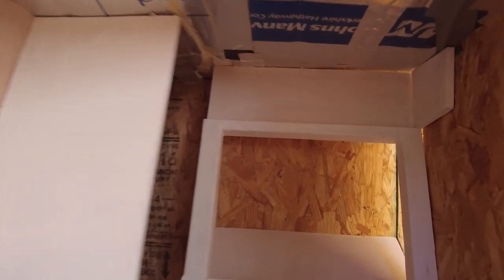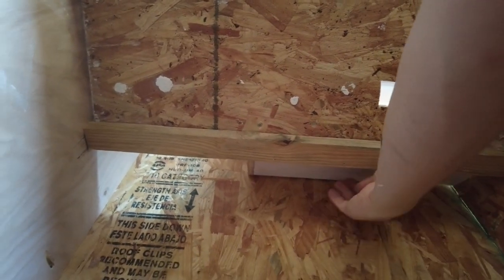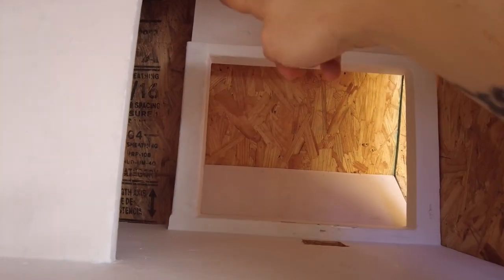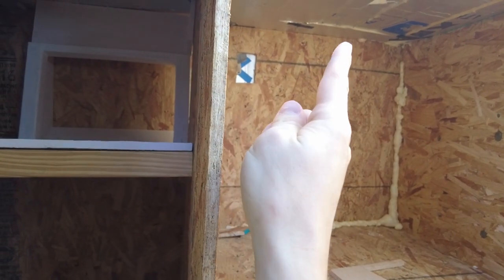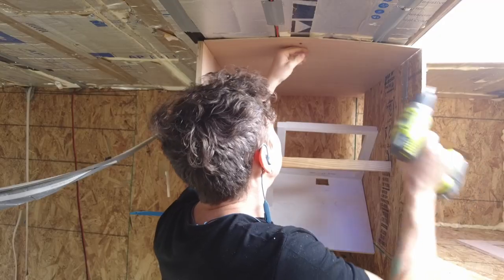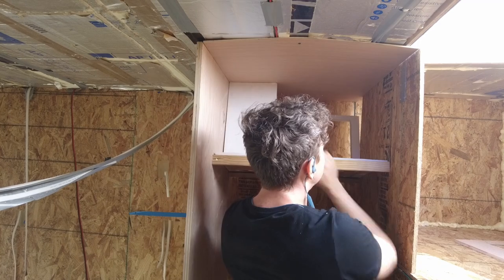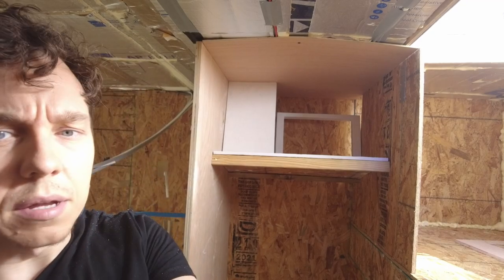So air comes in through the side over there. Got a good amount of space underneath for the air to come up. Gets sucked in, gets exhausted out the back through this, up and over and out. And then it'll go through ducts going up to the ceiling. I can't go straight up because I've got solar panels there. I think we get a ceiling panel up in here and start assembling. Temporarily in place, not permanently.